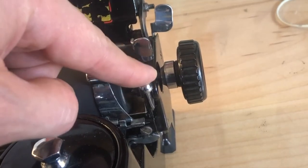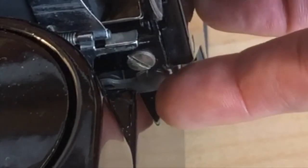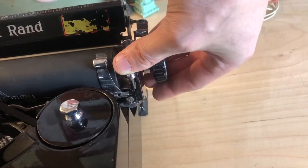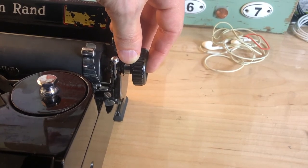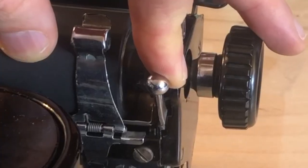For some reason I could not figure out how to get that thing in place, and then I did. I knew that this lever right here pushed down so that this piece right here was meant to engage with that cleft in this bar, but it wouldn't. I've since learned that this is a relatively common feature for Remington Rand typewriters. What you do is pull out the right-hand platen knob — see that? — then push the lever down and lock it into place.